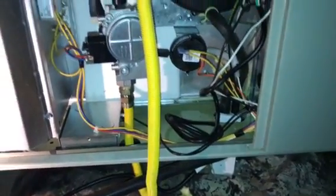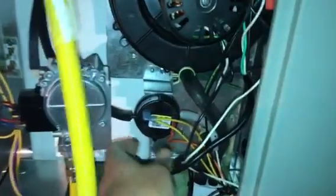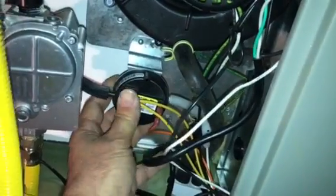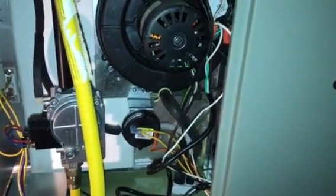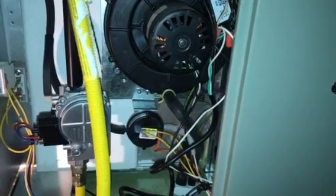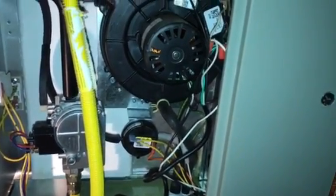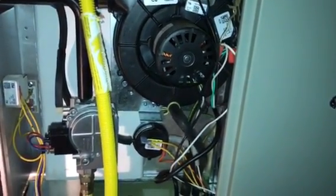Okay, it looks like that has definitely had an effect, because I took my jumper off and reconnected the, we call it a pressure switch, I call it a vacuum switch, and it fired right back up. I'm a little reluctant that it may have done that because the pipe is hot, it's all up and running, and I'd like to see it through a cycle.